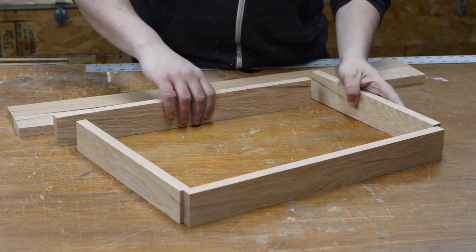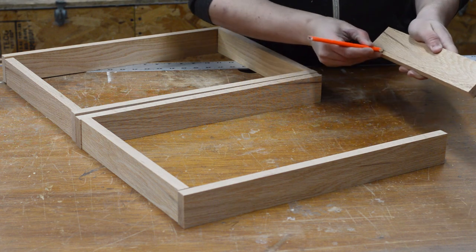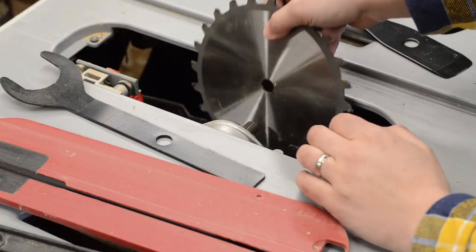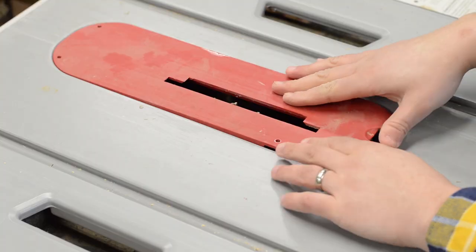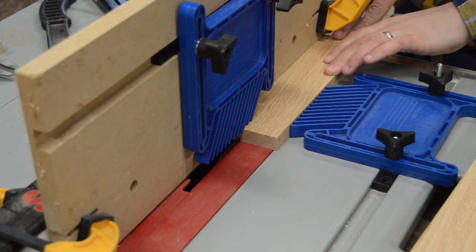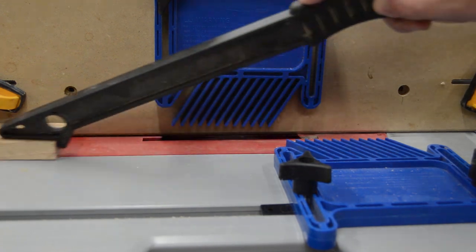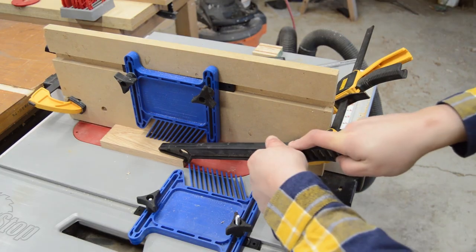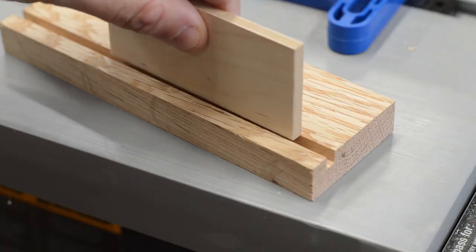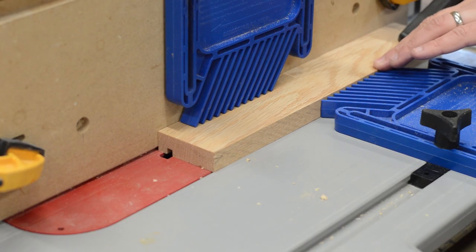This let the grain wrap around the inside corner where the parts meet. With the joinery I used, it doesn't matter nearly as much as if I were using mitered corners. After a quick mock-up of position, I marked the edges that would receive a groove to accept the tray bottom. To cut the grooves, I put just one side of my dado stack in the table saw. I borrowed a fence from my router table so I could have both feather boards in play, which helped keep the piece against the fence and get a consistent depth of cut. After running all the parts through once, I used a test piece to set up the fence to get a nice fit on the groove, and then each piece went through the setup one more time.